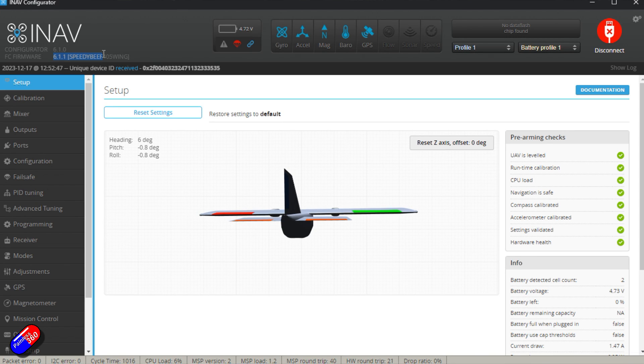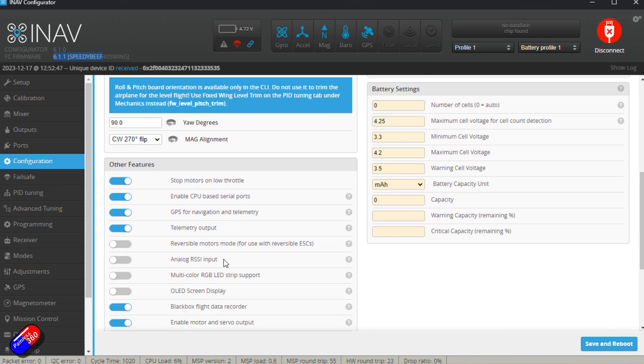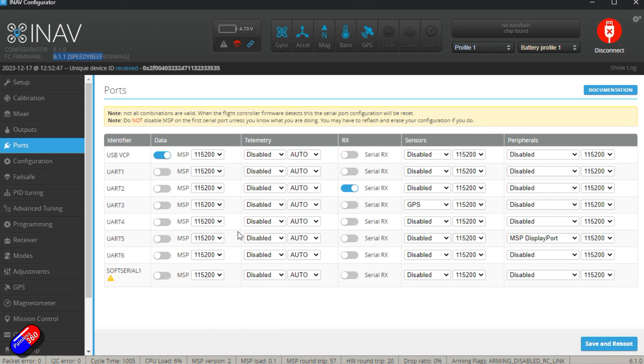I need to say a massive thank you to SPJV01 for letting me know that was the answer. So let me show you how to get smart port working with the Speedybee F405 Wing. I upgraded from iNav 6.0 to 6.1.1 — first saving a diff-all and dump from 6.0 for reference, then upgrading to 6.1.1 as normal and reapplying the defaults and checking all the settings. Once 6.1.1 was on there, I went in, enabled telemetry, enabled the soft serial stuff, and magically this time the soft serial port appeared. I set it to smart port and rebooted to confirm it was still there — and it was.